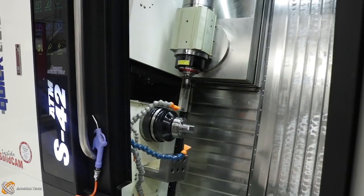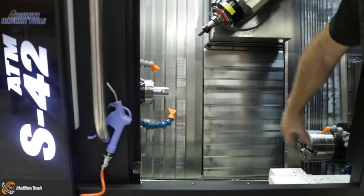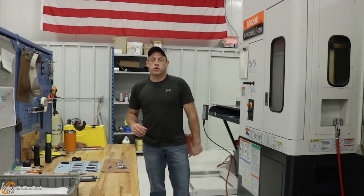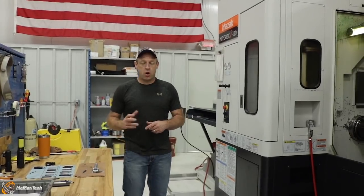This machine mainly runs stainless 17-4 grade and titanium, 1 5/8 bar capacity through the spindle. We bar pull almost everything we build with the sub spindle, and this is a done-in-one type of machine. Parts are run complete.